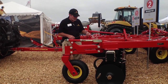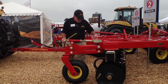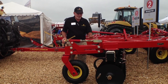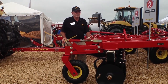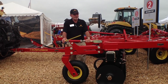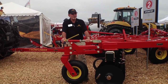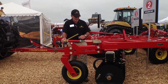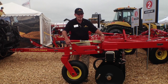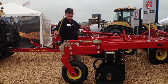We're almost finished — there's one more adjustment to make, and that is on our gauge wheels. We want these to carry some weight to prevent the front gangs from ever gouging, but we don't want to carry so much weight that we prevent the disc from penetrating. So we're going to adjust this wheel down to the surface of the ground and put enough pressure on it. We can determine if we're about right if we can kick the wheel and it slightly moves. We'll take that measurement from this side — from the center of the bolt to the center of the bolt — take it over to the opposite side, and we've got our disc set.